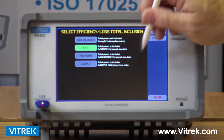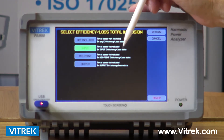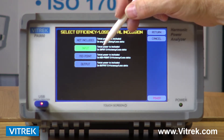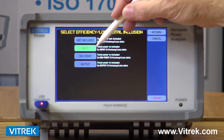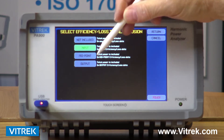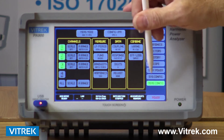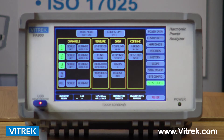Finally, using our VPAs or virtual power analyzers, we have the ability to monitor efficiency. For example, let's say I'm using two channels and I have a DC-to-DC converter. I'll assign one of my virtual power analyzers to the input channel and one to the output channel. Using the efficiency button gives you the ability to monitor different points — however many points you have — and you can measure efficiency at different points in a complete system.